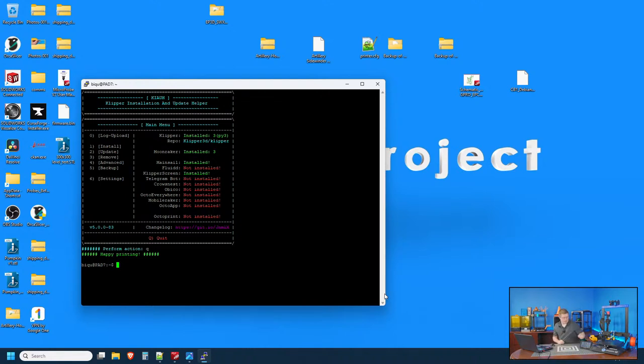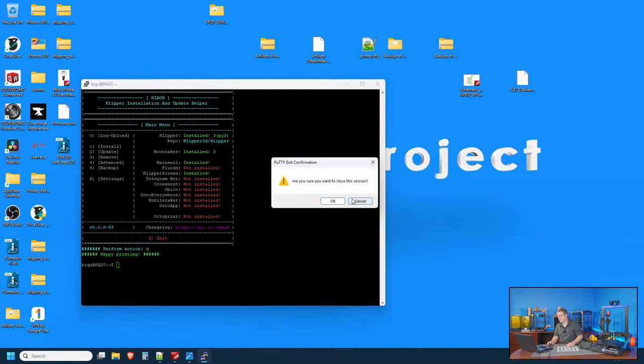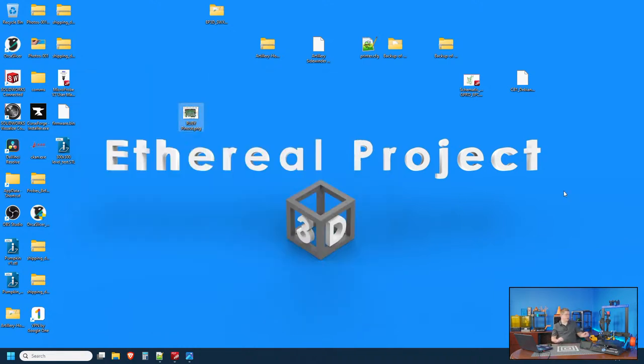shut this sucker down. And if Drew was here, he would be like, don't just turn it off. It's fine. You know what? That's what Drew gets for not being here. Right. Take it out of DFU mode, so remove the jumper. Some people don't remove the jumper, and they wonder why it doesn't work. Which is kind of funny. All right. And then power with main power.